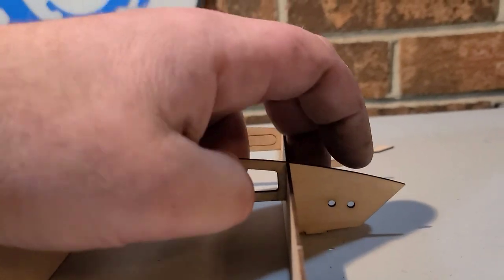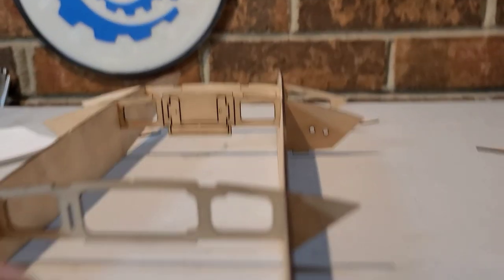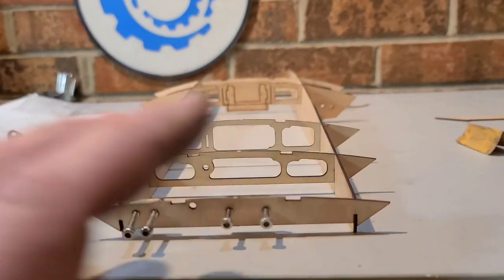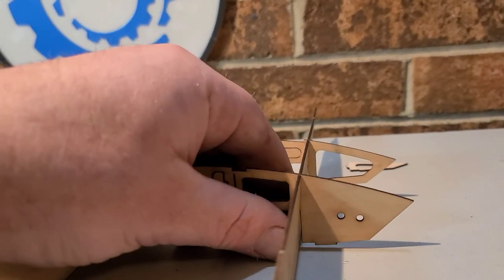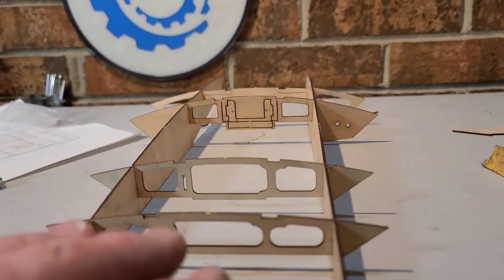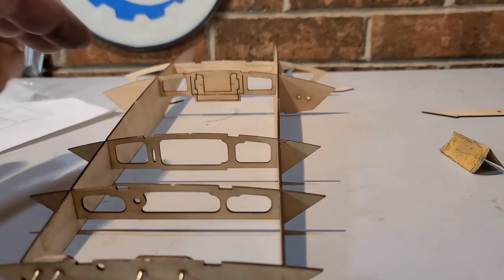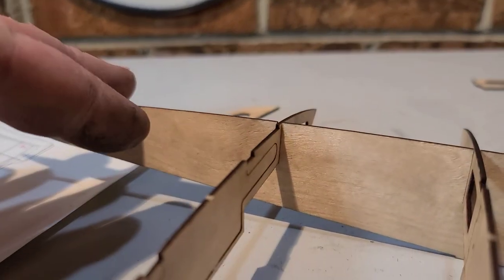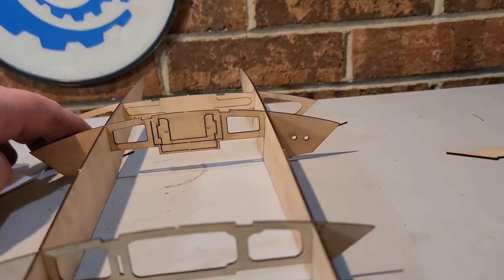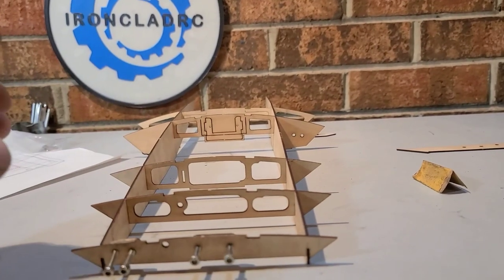it's actually doing okay. But once I push the stringer out, it sits flat. You see that? See how it's sitting flat now? But once I push this stringer up against the inside of the sponson right there, everything's pushed down. She's wanting to. And it's not the kit or the manufacturer, it's nature. And you gotta take stuff like this into account when you're building a kit or a boat or anything out of wood, really, anything really. You gotta take that into account.